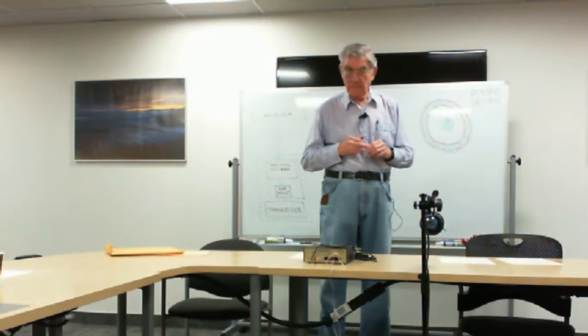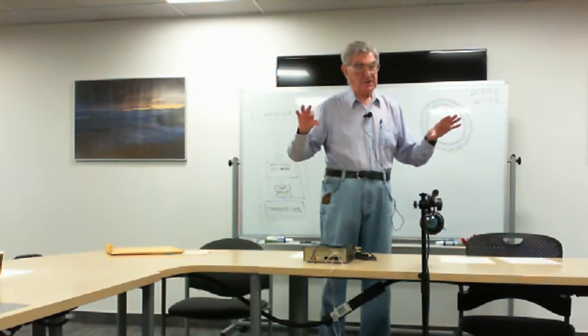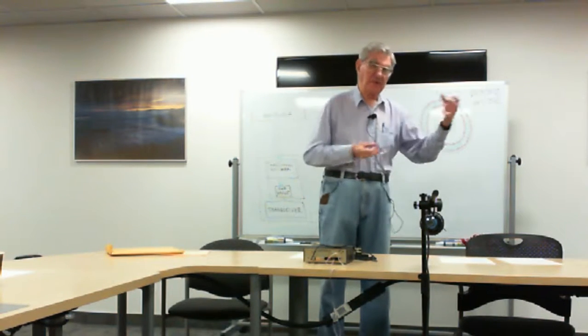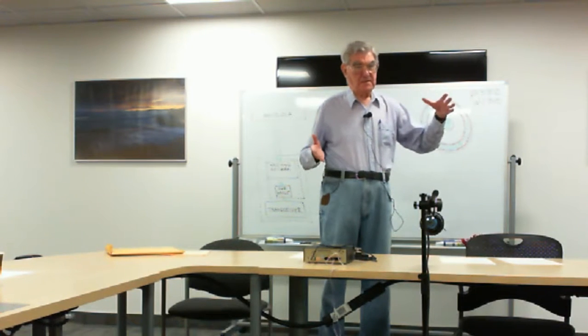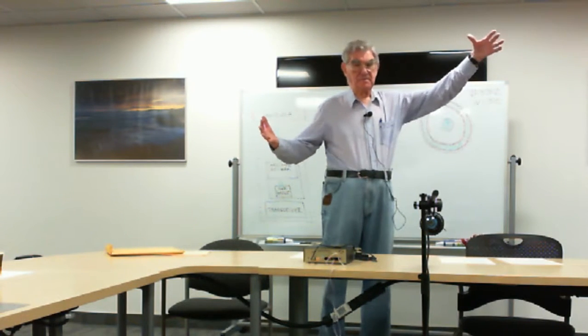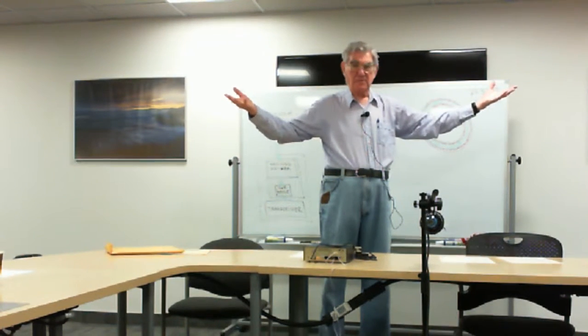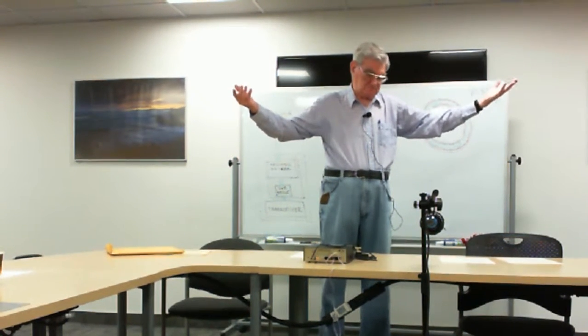For instance, both of the coaxial cables I've been speaking of tonight have a velocity factor of 66%. This means that the radio waves traveling in that cable move at only 66% of the speed of light, which also means that a wavelength in the cable is only 66% of the wavelength in free space. And incidentally, in the air that we breathe and live in, radio waves travel at a slightly slower speed, but the difference is less than 1%. It's almost the same.